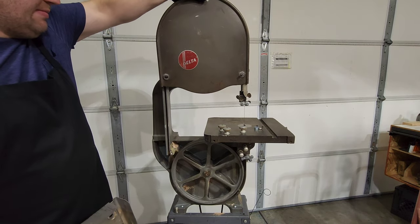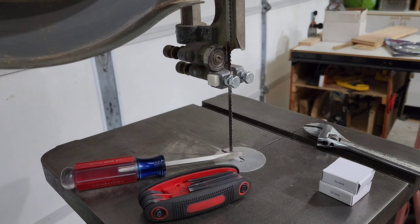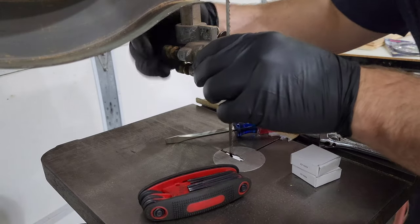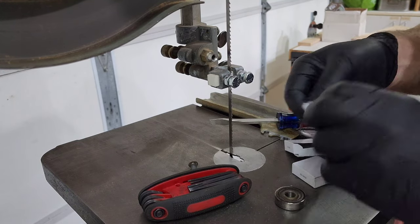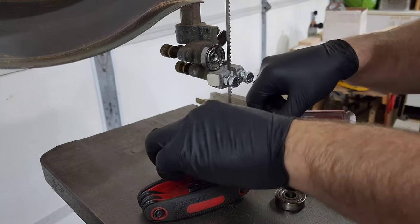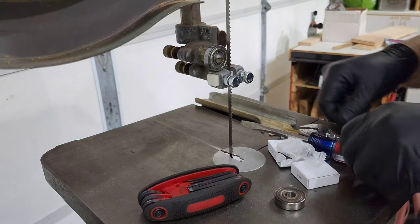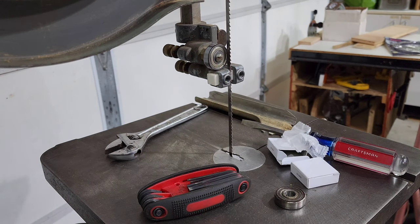This part of the video we're going to be tuning up the saw. What I mean by tuning up — that means putting in new thrust bearings. There are two of them, one on the bottom and one on the top side, that keep the blade from being pushed off of the wheels. I'm taking off the blade guard and replacing this bearing here. You can leave the blade on to do this — just be careful, don't cut yourself. Take a screw out and this bearing comes off. This bearing is a sacrificial item; they're very cheap and they're a ball bearing. Ball bearings aren't designed to be side-loaded, which this one is — that's the design — and as it's being side-loaded and exposed to a lot of sawdust, it will eventually fail. They usually fill up with dust and debris, and you'll see saw marks on them as they fail. Check them often, and if they don't spin freely, replace them. You can buy them in bulk — they're relatively cheap, and it makes your saw run better and your blades last longer.